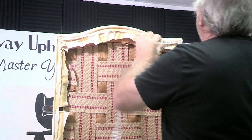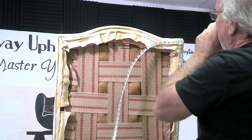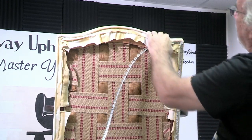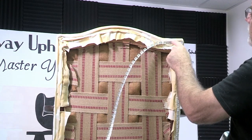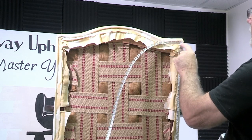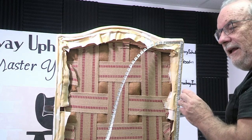Now I'm going to butt this in this way — you don't ever want ply grip overlapping. I'm going to get a couple more staples in here and show you how this is going to close up. On the ends, the little trick is I usually get a couple of staples in this way with the staple — it just kind of holds the ends better. What's going to happen is this is going to pleat — there's going to be a little pleat inside here and then it wraps around this side and then it's going to close.